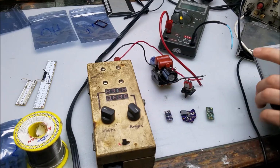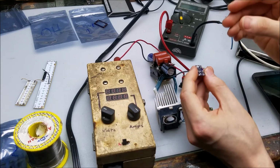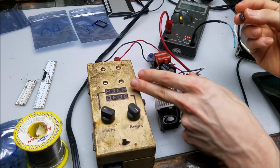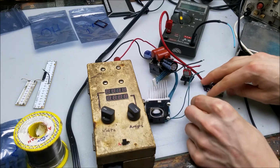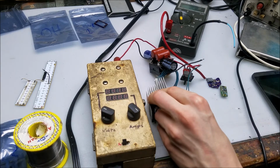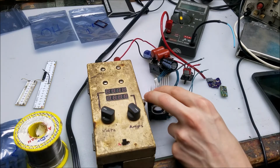Let's go ahead and verify that. We'll test it as you would test a red or infrared laser diode on a buck. So that's a single cell range. We're going to be going from 3.5 volts about all the way up to 5 volts and seeing how that holds up. And we'll go ahead and connect it up to a higher voltage test load and test how it would work on, say, a direct diode, green, blue, or violet. These laser drivers can handle an input voltage of up to 16 volts, so they're really versatile.